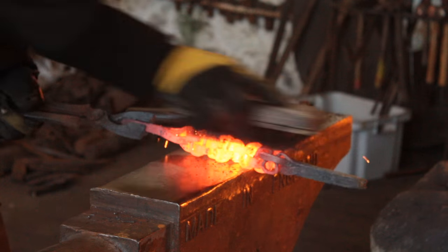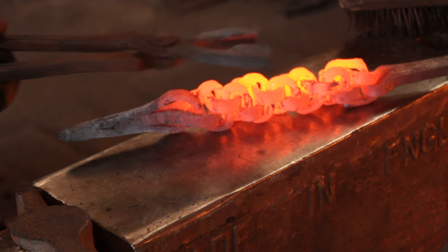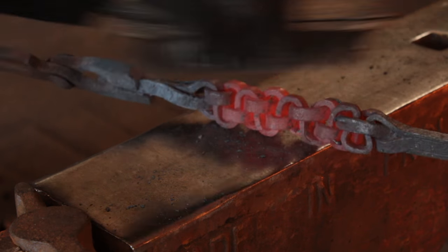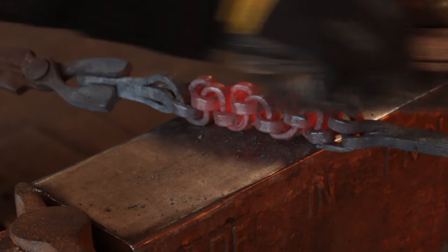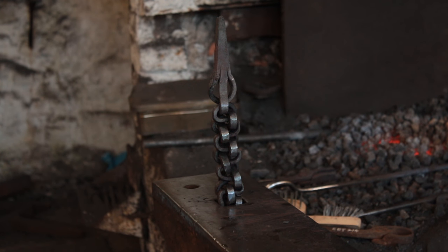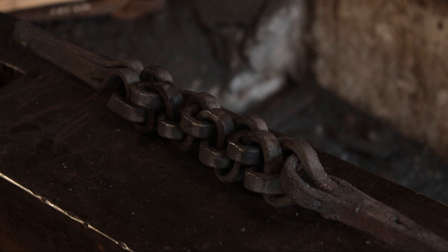With all that done, give it a good scrub and I'll tweak in the braids. You can see the braid is left-right-left-right-left-right in the way the bars intertwine. If you look at the drawing by Mrs. Valerie Fenwick you'll see the braid is set up the same way — left-right-left-right-left-right. My section is a little bit chunkier than the original, but not too worried — it's come out fairly decent. For the next episode we will forge those external elements, weld it all into place, and offer it up to the ring.